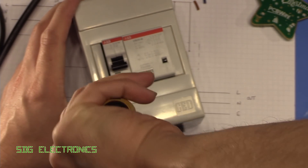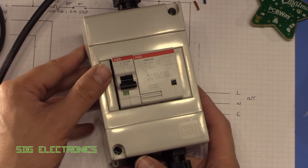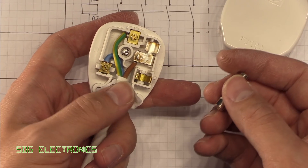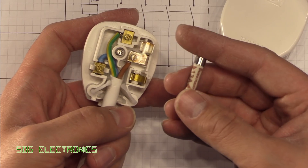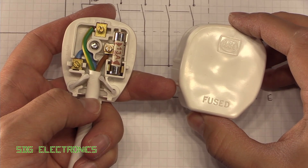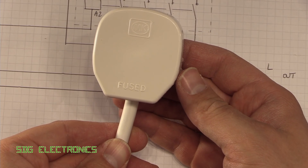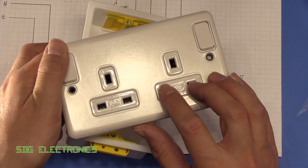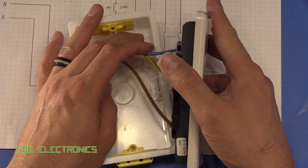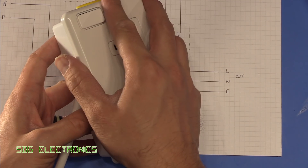That was a little bit of a tight squeeze to get everything in there, but I think we've got it all in. We can mount that underneath the bench. I just need to stick a plug on one of the cables and a trailing socket on the other. Here's the inside of the finest electrical plug in the world — three terminals and a 13 amp fuse very tightly gripped inside this MK 1363 plug. At the other end of the cable I'm using an MK metal clad socket — these are really nice and high quality.